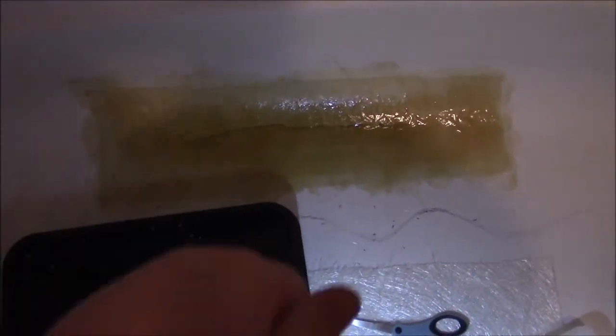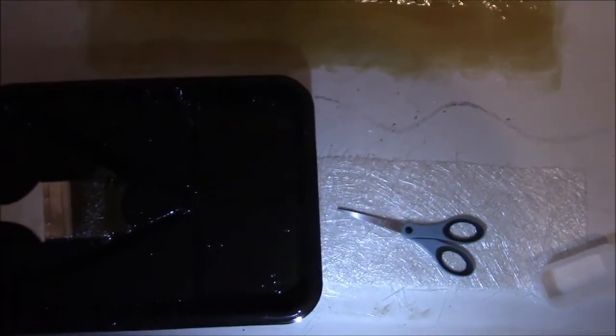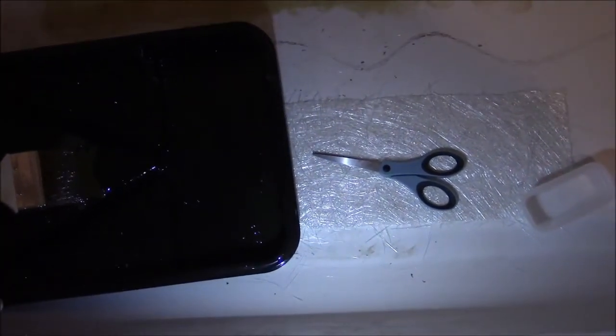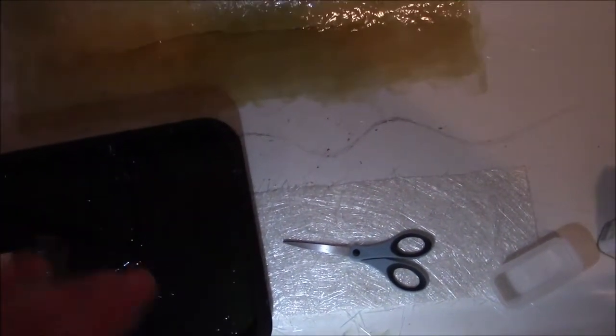And what I want to do is let it actually semi-cure, so I can repeat the process, kind of score it a little bit. And there's my phone vibrating. I just used it for the light down here. I want to let it semi-cure. I'm going to take the wire brush there and score it a little bit when it's hard, so that the second coat of epoxy, or second coat of resin, whatever you call it, will take. It'll take either way, but still, I want to be double sure.